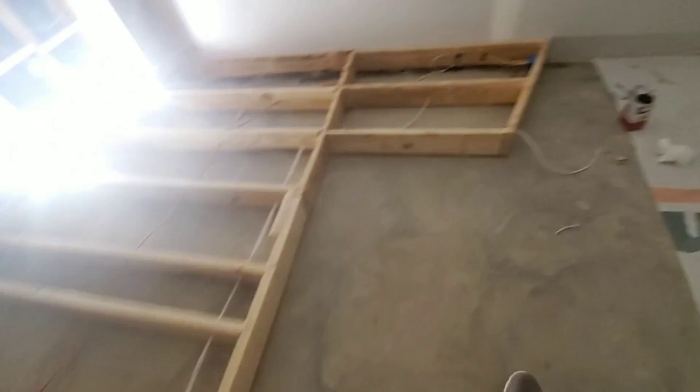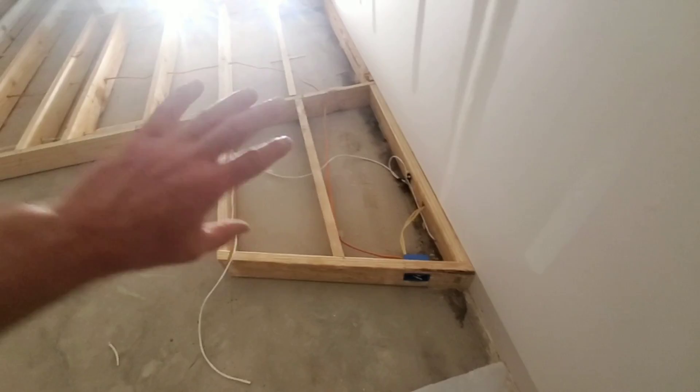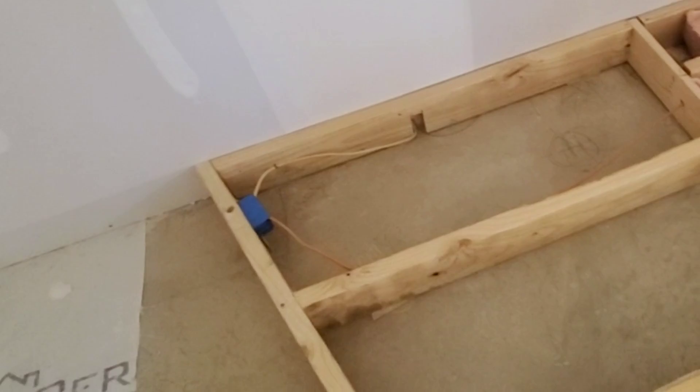If you're wondering why there's an orange cable instead of yellow going to that outlet — I didn't have any more 12-gauge or 12/2, and I wasn't going to go out and buy some just for this little bit. I had some 10-gauge on hand. All the circuits and outlets in the house are 20 amps, so they're all 12-gauge, but I just grabbed some 10. It's a little more of a pain to wire but it'll be fine — saves me money and time. So we've got that coming over here to feed the outlets for the chairs.